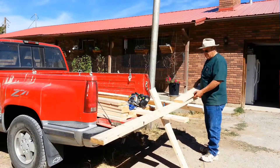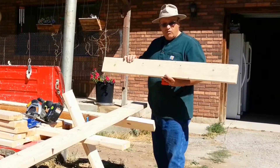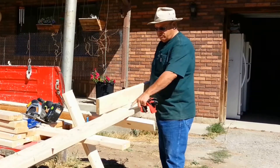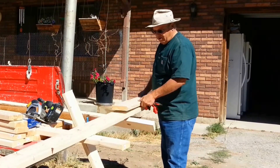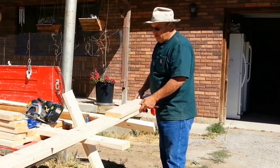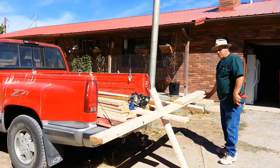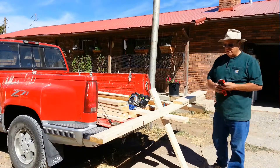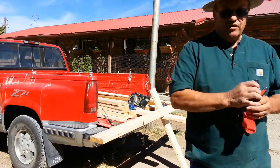The way we're going to do it is, as you see, I've sawed one of these in half. This is going to be the splice board, and what we're going to do is put some construction adhesive on here and clamp that down to that one. And then we're going to take another one of these and put it on this end and clamp it down to this one. Now, there's another thing that we've done that we've got to take note of.